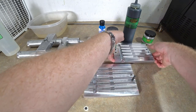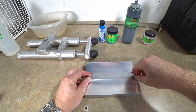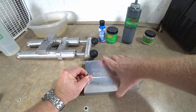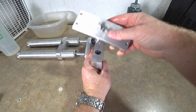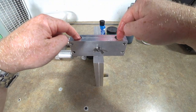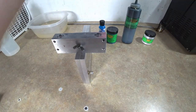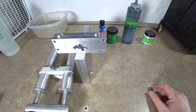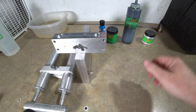So I'm gonna put the rods in and close the mold. All right, and I wanna make sure that it closes very tightly, so I really tighten those a lot. And then we're gonna shoot a laminate the normal way with the two color blending block. So one side, then the other side with the twinjector. And that will shoot our shells. And then after that, we'll take the shells out, we'll make a few more. We're gonna just make a bunch of shells first and then we'll work on the core.